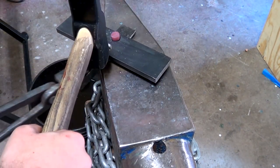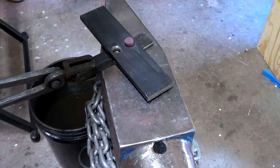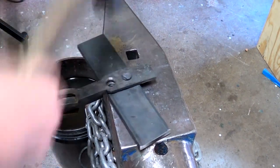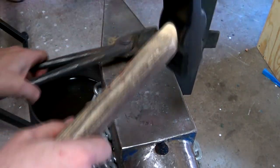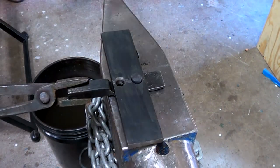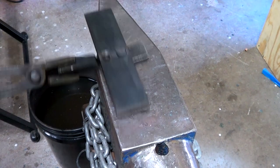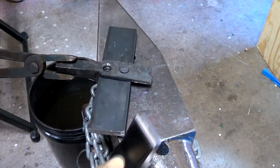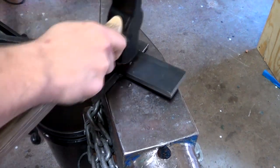But as you're about to see, riveting is one of my weaker suits in blacksmithing, so I wanted to give this a shot. The main issue you're seeing here is that I didn't get the rivets hot enough, so by the time I had them positioned, they were too cool to move significantly. A spacer between the workpiece and the anvil would have helped too, but I get a sufficient joint for the usage this tool will be seeing.